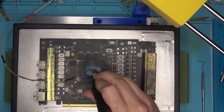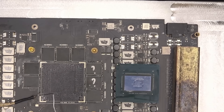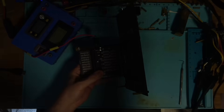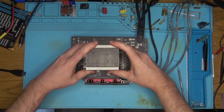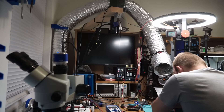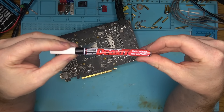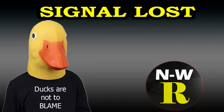So I'll lift the core one more time, and... yep. As you can see here, the core is not soldered completely. Both left and right corners are sitting low because the middle is sitting high. I'm gonna have to fix that somehow, maybe with some weights. After reballing the core yet another time and verifying the data lines, powering it on again — it has the exact same problem: no detect, no display. What if the problem is the riser? These risers are always causing weird problems, especially after heat cycles, so let's deoxit the pins, apply some gold guard, and try again — and still nothing.